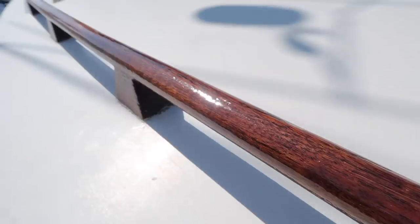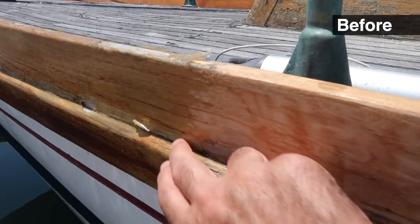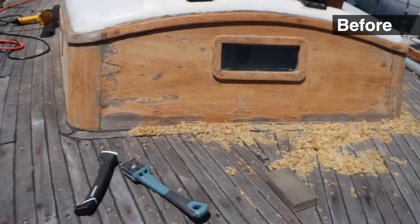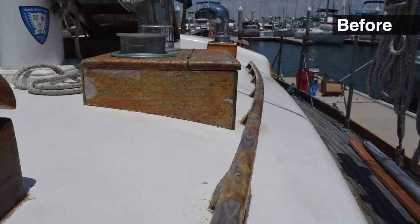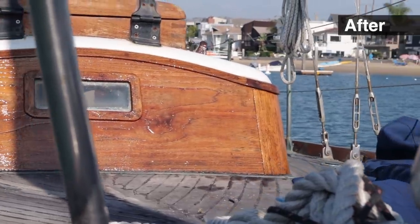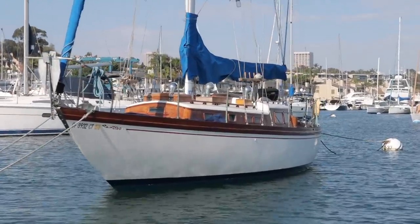So I made it onto the boat. Looking at myself here — I wanted to point out something: my hair has been getting so gray right here that I decided to go ahead and bleach the top to match it. Now it's just completely white, out of control. Anyway, now that we've made it onto the boat, I really wanted to show you the progress I've made — some before and after shots. I've stripped most of the varnish, re-varnished the toe rails, re-varnished around the entire cabin, and re-varnished the handrails.